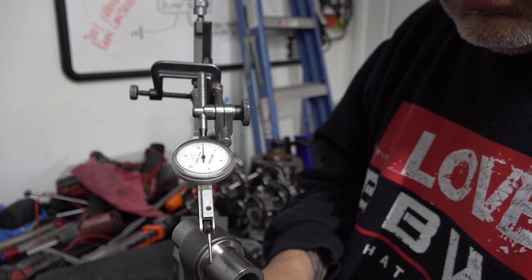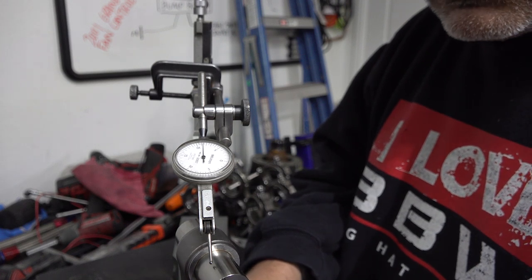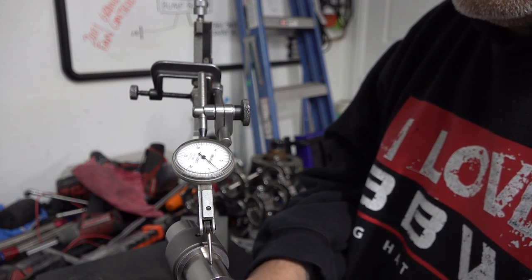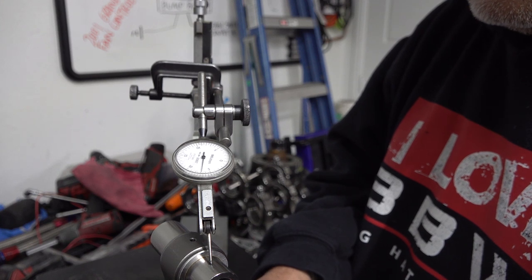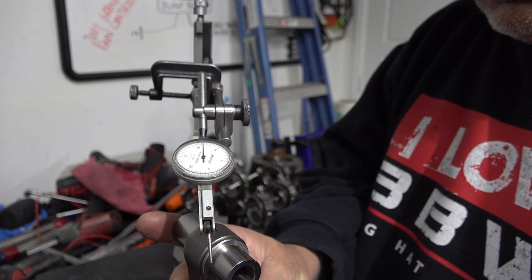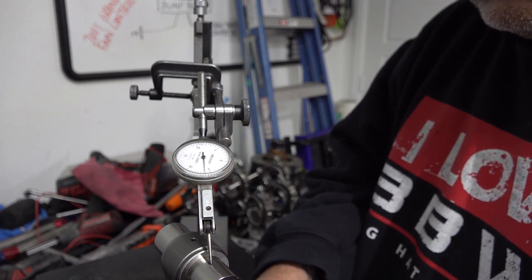I couldn't handle those results being just good enough, so I set up a different scenario using a test indicator so we don't have to move the height gauge around. If you watch the needle, it looks like we're going about plus three, maybe plus two and a half to three somewhere around there. If I turn this around it looks like we're going to get about plus six and a half, so we're somewhere in the neighborhood of about three thousandths of tilt to one side.